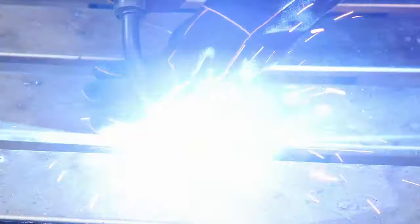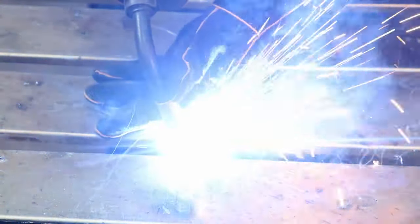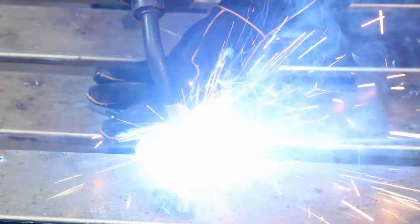The wire speed is the main setting; we'll walk through how to dial in your voltage based on that wire speed by running test welds on scrap metal. One important note: if you're welding in vertical or overhead positions, dial it back a little — about one material thickness lower — and it's best practice to dial in the weld in the same position you're going to run it.